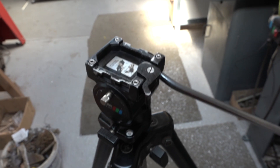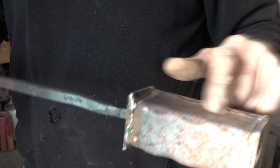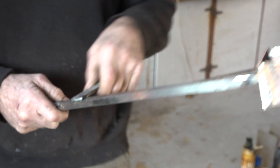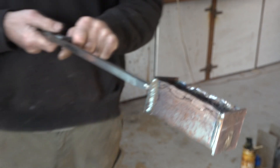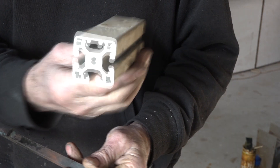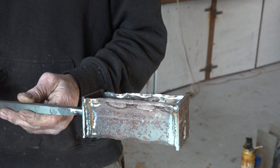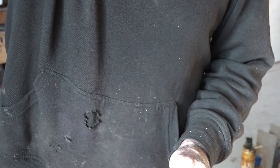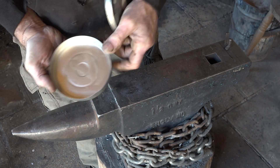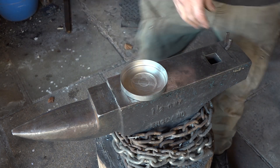I don't have an aluminium block thick enough to make this shoe. I have got a graphite crucible but I haven't yet made a foundry to put it in, so I've made up this little crucible which I'm going to slot some aluminium bars into — this is what I'm going to make the glide rail out of. I'm going to melt it down and cast the block. Here's an old tin I've got; I'm going to use this to cast the aluminium — it's just about the right size and it'll certainly be thick enough.